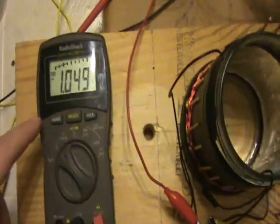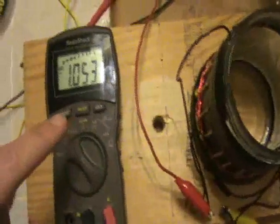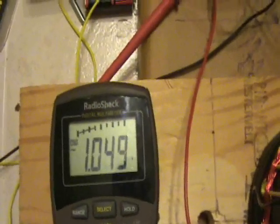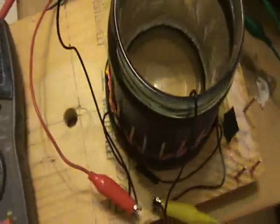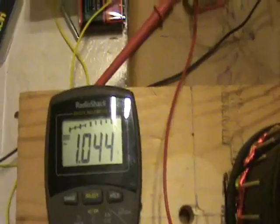I've added the multimeter into the circuit so that it's between the antenna and this coil. We are measuring AC voltage and we are measuring about one volt — just directly from the antenna we are picking up one volt. Basically this tank circuit is resonating all by itself, no supplied energy, providing one volt out to this antenna as a carrier wave. That's why it's easily detectable by a radio.